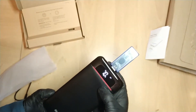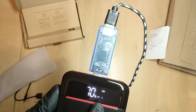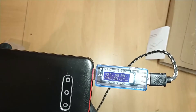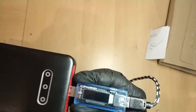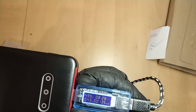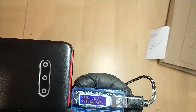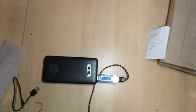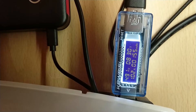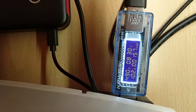We also have three LEDs on the bottom — normally you'd have LEDs on the side but because there are three USB ports that's not possible. There's one slight problem: my USB power monitor is displayed on the opposite side to the display on this device. Touching a device to the USB monitor tells you which output is in use. I don't seem to be getting the 2.4 amps out of the USB connections.